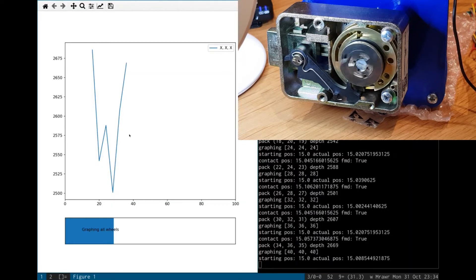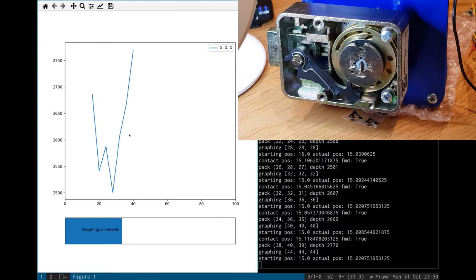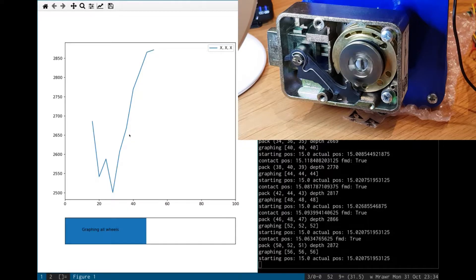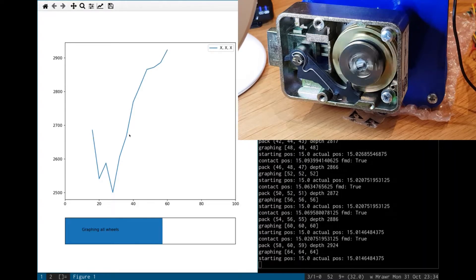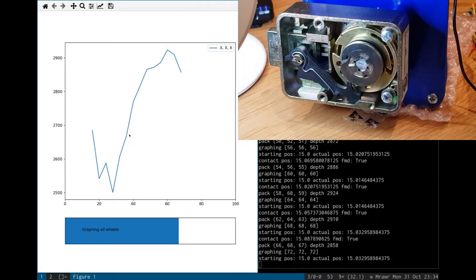The 1548 is rather cheaply made, and the wheels have a pretty big hole in the centre — bigger than the shafts they run on. So in addition to spinning, they can slide from side to side, and which way they slide depends on which way you spin them. So to avoid big variations in the contact point readings, I go to great lengths to only rotate each wheel in the same direction consistently. That takes a bit longer to dial, but it gets a better graph.